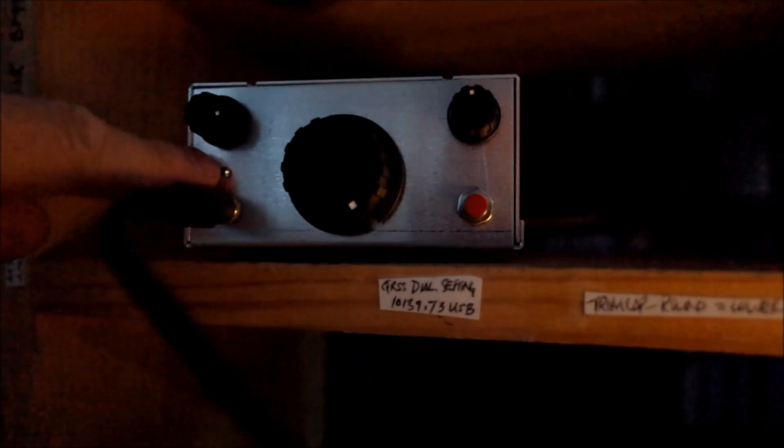That's that little LED for the AGC. Three parts: an LED, a capacitor, and a 1 mH choke make up the AGC. It's pretty neat. And on top of that, the LED doubles up as a sort of indicator.